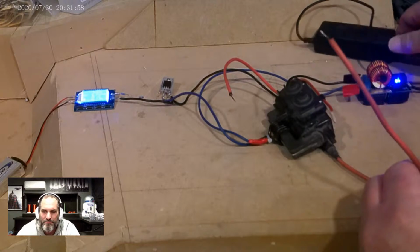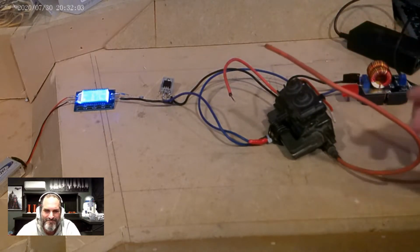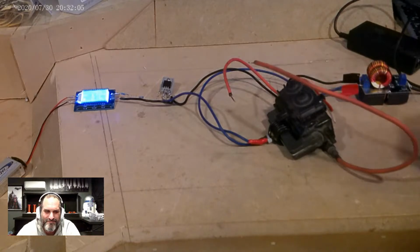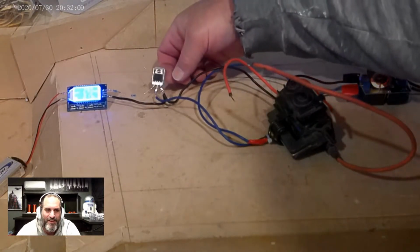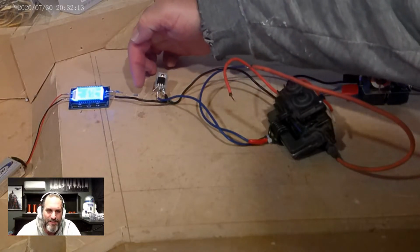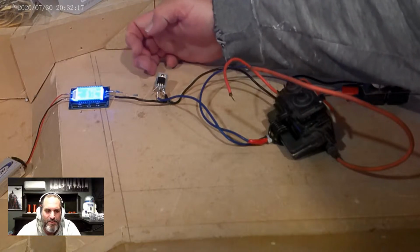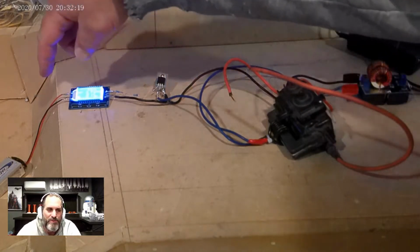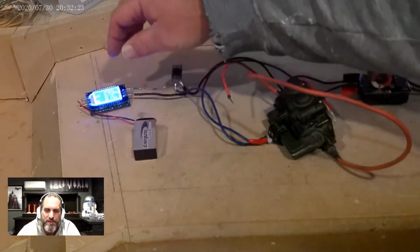Now, I'm going to unplug this real quick. Now, let's take a look. No voltage left on there. This MOSFET's pretty hot. It's the Z44. Dude, that Z44 is junk, man. I can't even get one to run these days. I'm lucky it did, and it stayed alive that long. But it did change the frequency of it. When you change the duty cycle, it changes how many amps it gets.